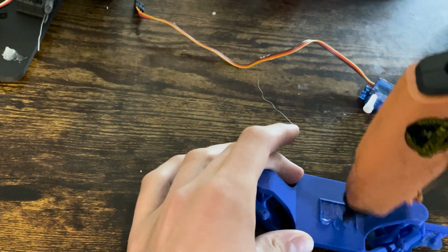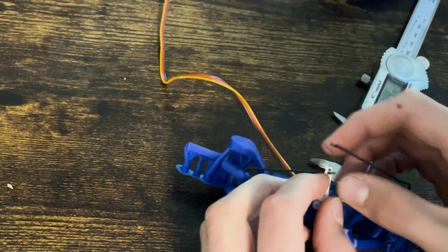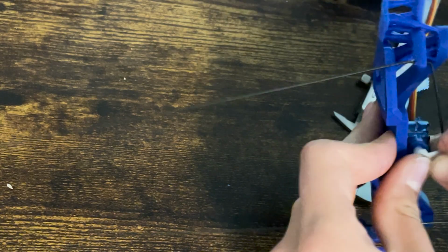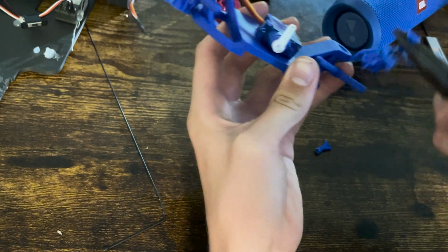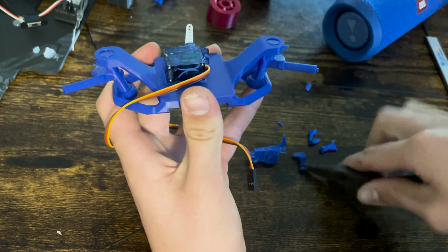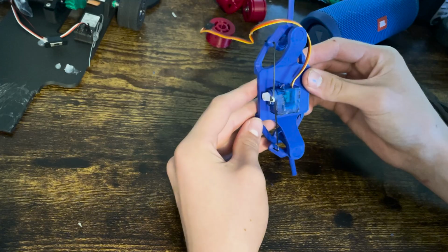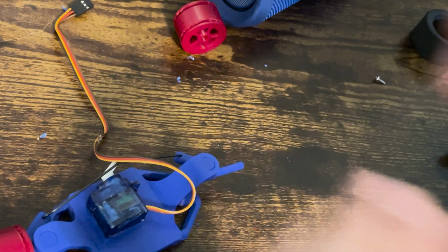Last video, I used paper clips as steering rods. Not exactly sure what I was thinking then, but surprisingly, there was never an issue with them. I'll be replacing those with genuine control rods because another one of my goals for this second version is to tighten up the steering. There was too much play in the overall system, causing it to get very squirrely at higher RPMs. Now that all that stuff is out of the way, it's time to start putting it together.